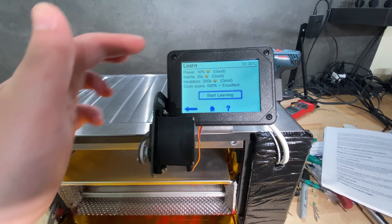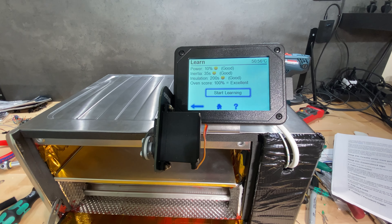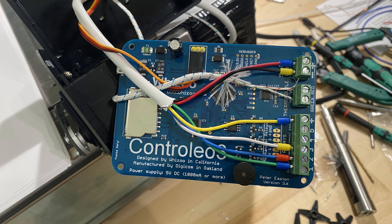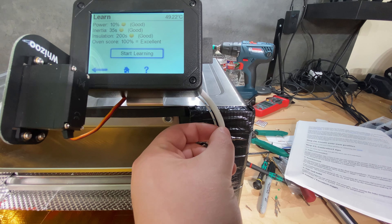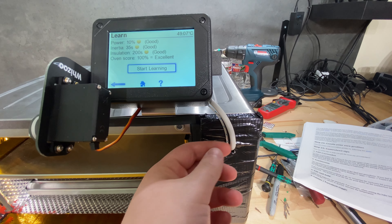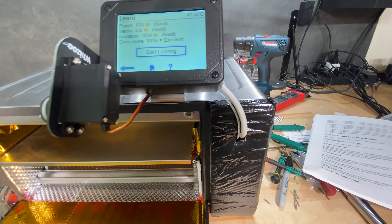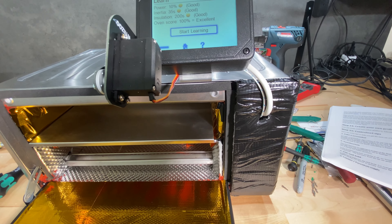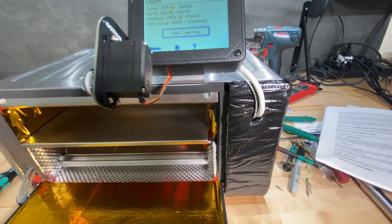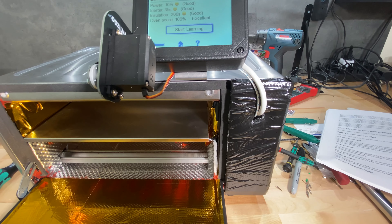On the controller side, there are a bunch of screw terminals on the backside for wiring the SSRs in, and they mean for you to just screw in bare stripped wire without a ferrule — no ferrules are included. I used ferrules myself because that's the correct way to do it. Another fail: there's a multi-core wire included in the kit, which in theory would let you run one wire, but it's short two conductors so I had to run the thermocouple separately. And even though this is 20 gauge wire, which is thicker than you need, it's copper-clad aluminum — extremely stiff and a pain to work with.